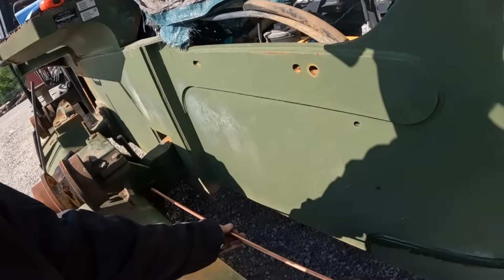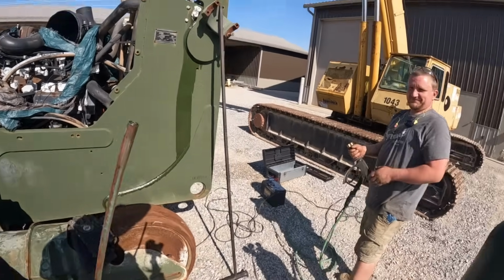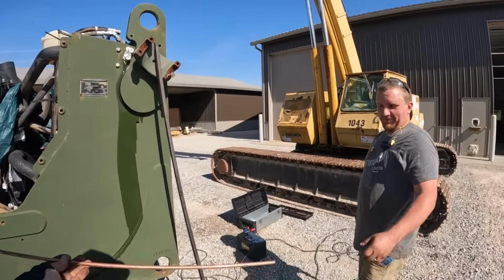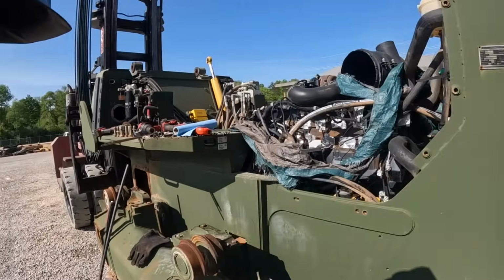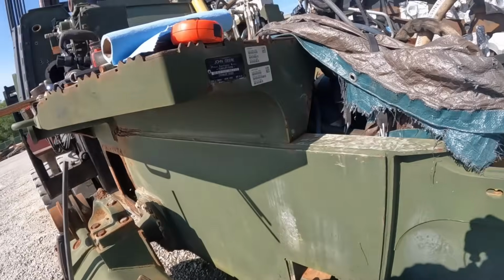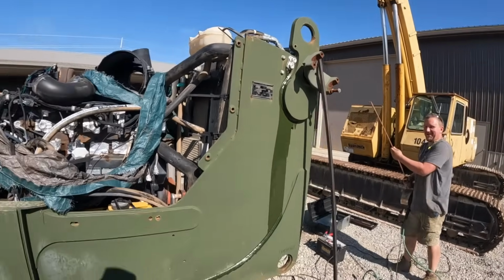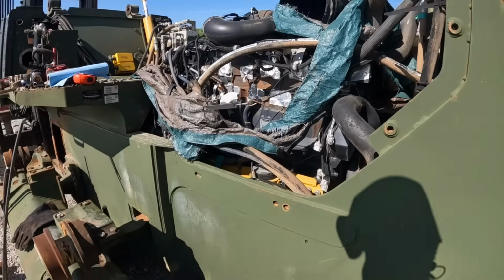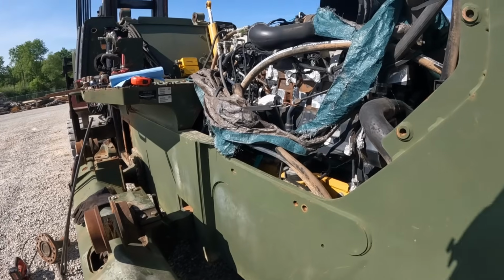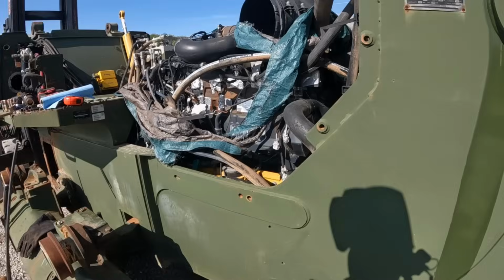What we're going to do, we're going to bore a hole straight through the middle of that pin. And if I don't go straight through the middle of that pin, we'll make a new hole. So it's real important to stay straight when you go in there, because it's all or nothing. Kevin's done it once. Yeah, I almost had a bad news bears call there. It's a fast machine.